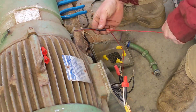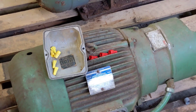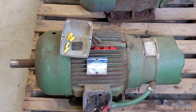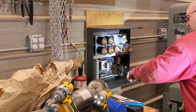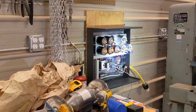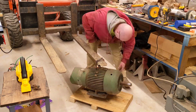I have tested it and it does work — it does generate power. I'm gonna get this thing installed and see if we can get this grinder working. Here's my motor: this particular motor is from the Brook Motor Corporation. It's an AC induction motor, it spins at 1720 RPM, at 220V it's 38 amps, at 460V it's 19 amps. It's a three-phase motor, 15 horsepower, 60 hertz — it's a beast.